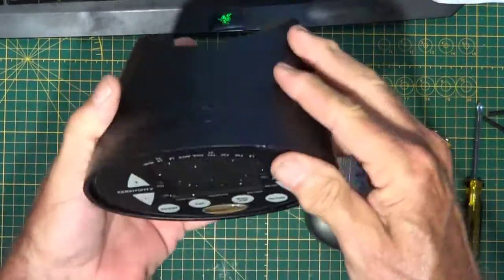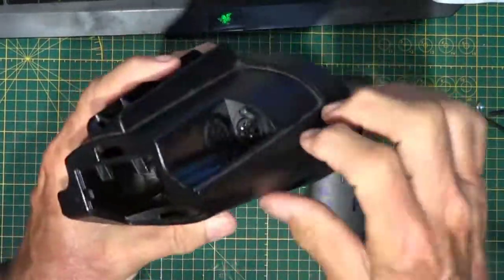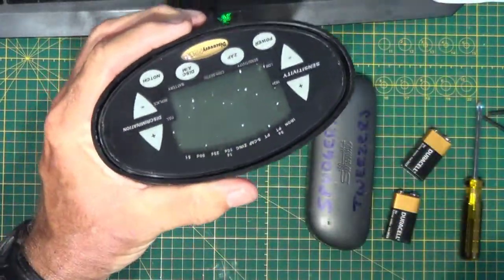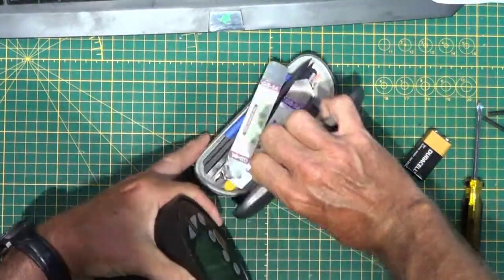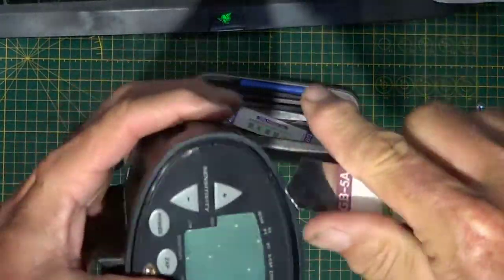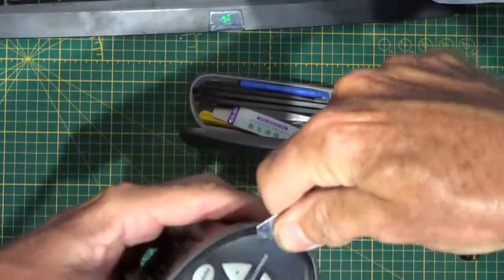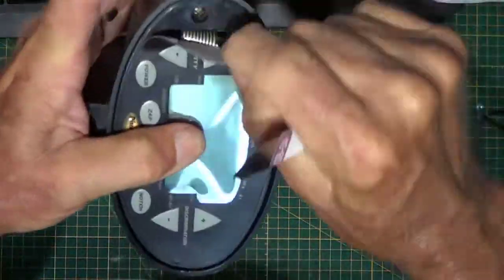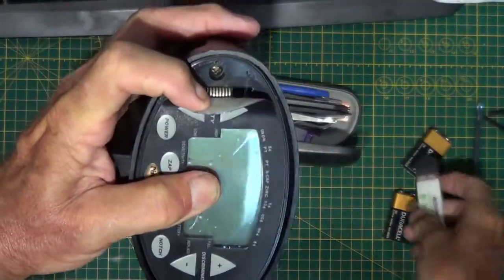Now there's no screws anywhere to see how to get this thing apart. It all seems to be one piece. This flexible panel comes off with the use of a spudger. A spudger is used to pry open these tight electronics. You can see I've been in there already. Peeling this little bit back will expose a screw.